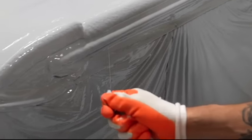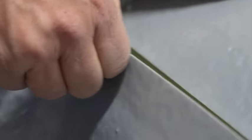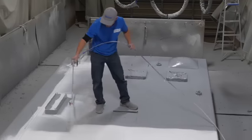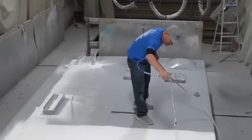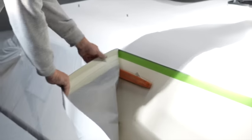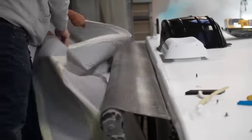Next they remove the wire tape, which cuts a clean finish edge throughout the FlexArmor membrane, and then they apply a white UV coat on top which helps reduce heat and insulate the roof. From there they remove all plastic and paper covers and let the product dry before reinstalling accessories like vent covers, solar panels, or drain cover caps.